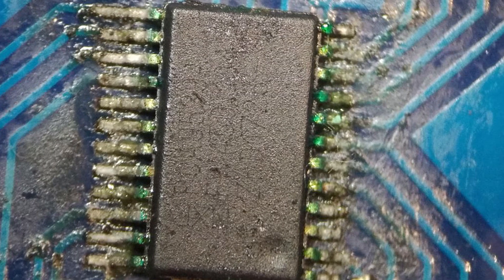That's only one part of the problem. The second part is that the flux activity also increases. A chemical reaction starts between the flux and the metal surfaces. Green oxide coatings appear on the PCB, and white or gray deposits appear from reactions with lead and other metals on component leads. These ionic residues begin to conduct electricity. These processes may not start immediately — sometimes after a week or even a month. It doesn't matter what you use to clean low-quality soldering flux; it will cause problems anyway. Alcohol just accelerates them. Don't be too happy if your PCB works fine right after soldering — it might fail very soon.